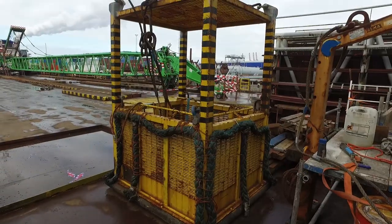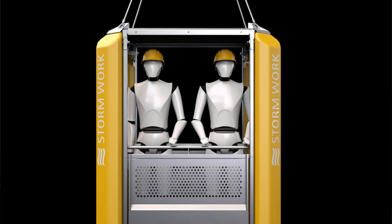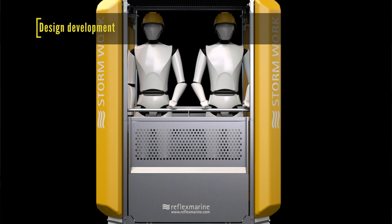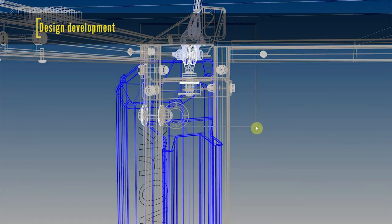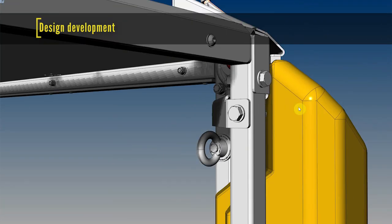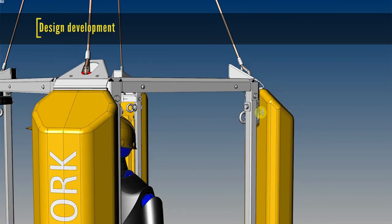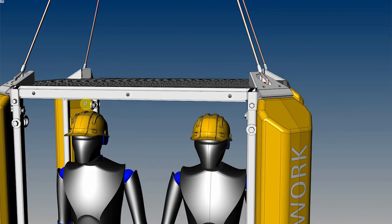Storm work is addressing four key risks. There's the integrity of the equipment itself as a piece of lifting equipment that has to suspend personnel. There's the risk of impacts during the operation — lateral impacts in particular. And there are also issues of snagging when you're making manoeuvres with equipment, possibly snagging on some nearby structure.